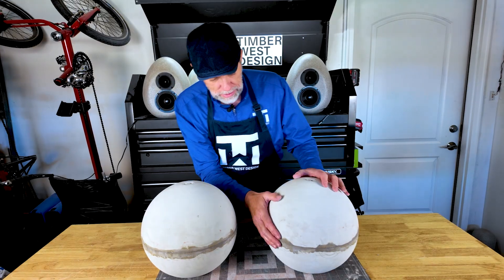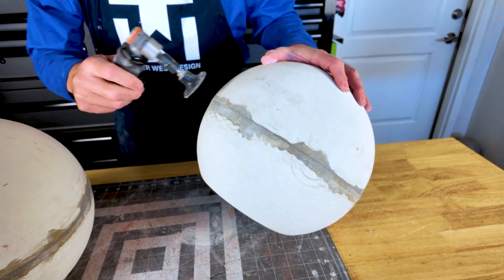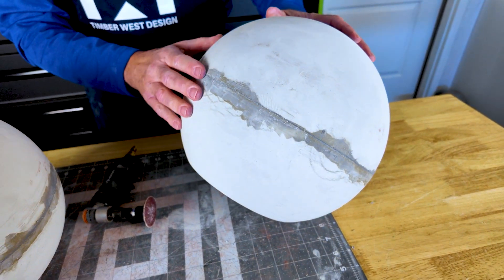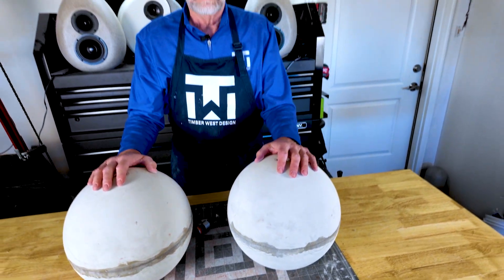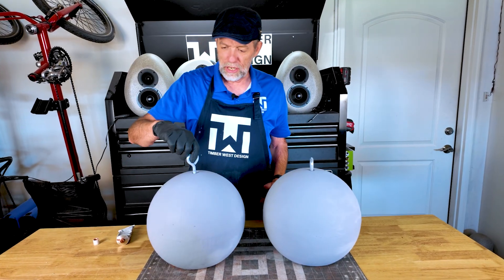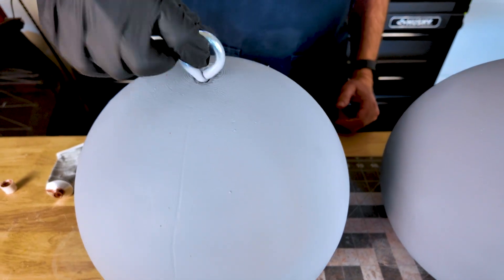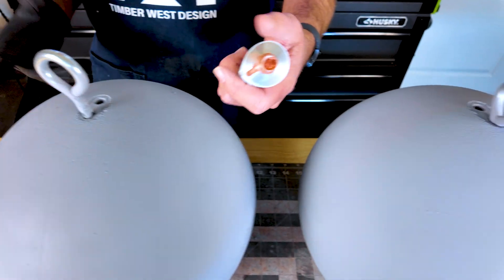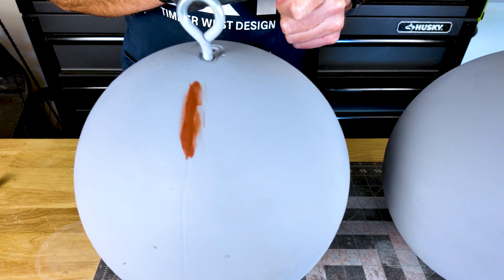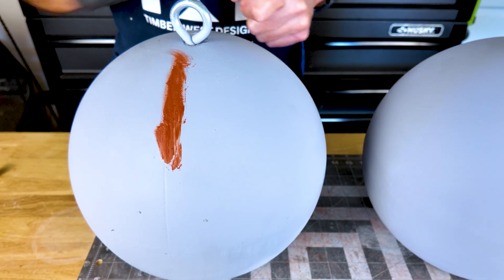It's been a couple of days — the adhesive is plenty dry. The next step is I'm just going to take an angle grinder, go through here, get that nice and smooth, and get it ready for primer. First coat of primer is dry. I put these eye bolts in with a wood block on the inside to spread the load so it's not point loading — you've got to hang them to paint. The next step is some spot putty for a few minor things, so they're looking really good for the paint job tomorrow.